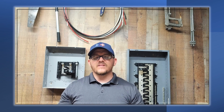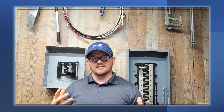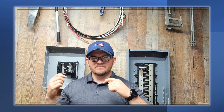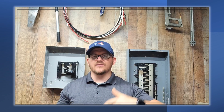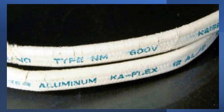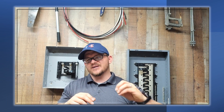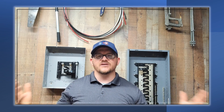The third thing to watch out for is the wire expanding and contracting as it gets hot. As the wire starts to oxidize and it's brittle, it expands and contracts, creating problems. It separates away from the screw on receptacles and switches — and receptacles are probably the most dangerous thing, because we're plugging in high-wattage appliances. With the heat from oxide, from over- or under-torqued connections, it just continues to exacerbate the problem. As it continues to grow, it's going to arc, spark, and potentially cause fire.